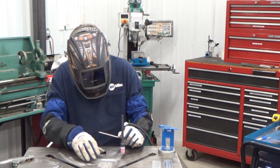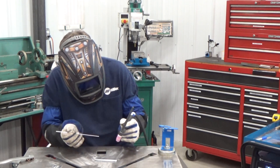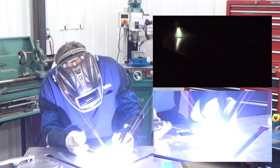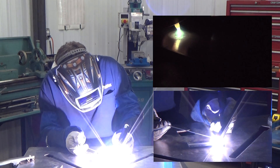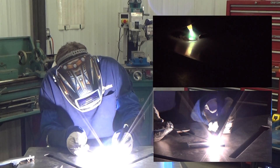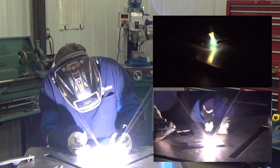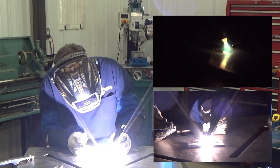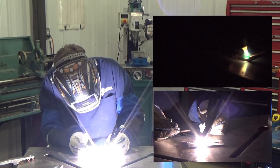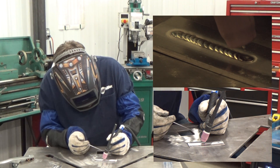Let's take another look at that. Remember to only put one or two passes on your test piece so that it doesn't get too hot. We're going to do that dab and move again — increasing the amperage. You can see I'm adding the filler metal just to the leading edge of the puddle and then pulling it away from the arc. I don't want to leave it sitting under there because that arc stream is going to start melting my filler metal. If you ever see a big booger on the end of your filler metal, it's because you left it in the arc stream too long.